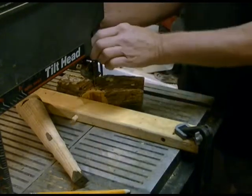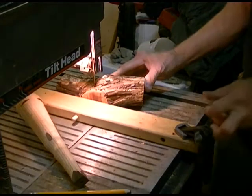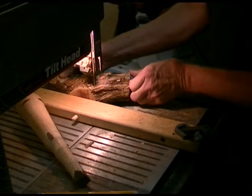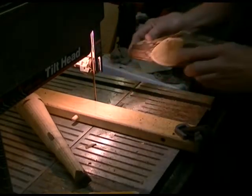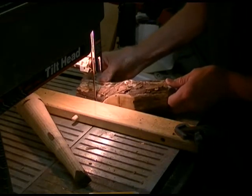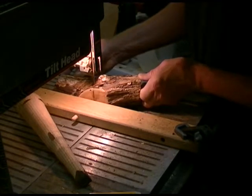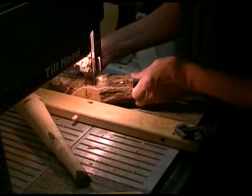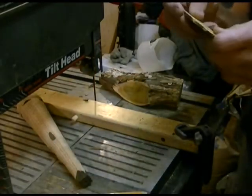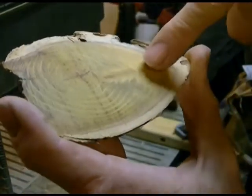My guide was just about to hit this knot here — we're going to raise that up just a little bit so we can get past that and make another pass. I'm pulling almost as much as I'm pushing to keep this from rocking as I go through the blade. Let's get a look at some of that wood grain in there, some of those internal patterns. We have a nice check here, and we notice it's starting to get oval-shaped in the grain because we're going around the corner.